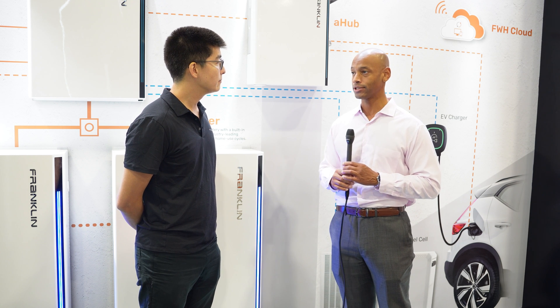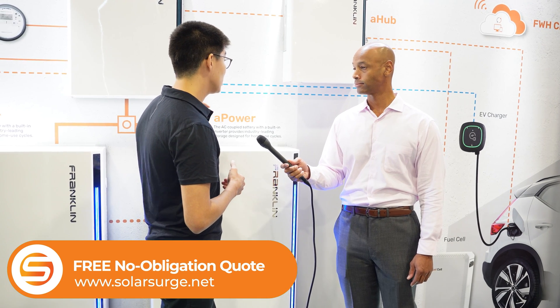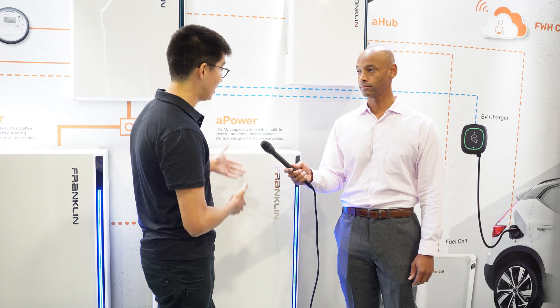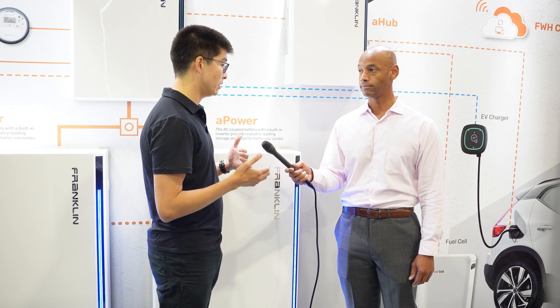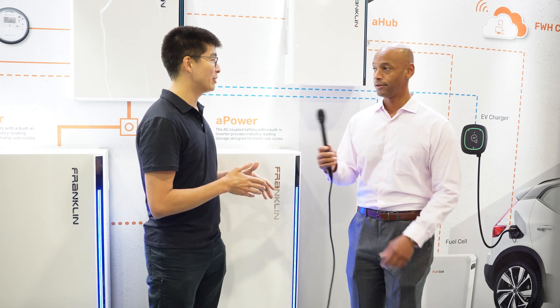Over the past year we've had a number of deployments go out, so there have been lessons learned as we've gotten more systems deployed and more field feedback. Can you tell us what else has changed on the base Franklin A-Power? We always listen to feedback from our customers and installer community. We have just launched firmware updates for the 208-volt multifamily split phase. So if you have more people living in townhomes or multifamily communities, you do have a backup power option with Franklin — and we're the only California state-registered multifamily backup power option with a battery system at the moment. We also have enhanced charge rate on the photovoltaics, so you have more design flexibility, and that translates into better Black Start capability too.